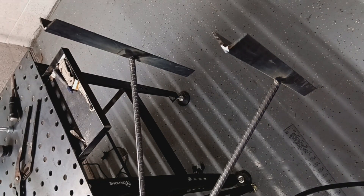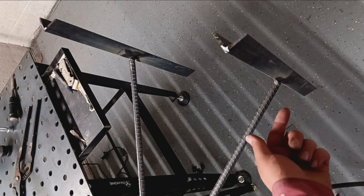There we go — I have both feet welded on. It was kind of a pain. Basically what I ended up doing was centering them with the table and then leaning the stand against the table while I tacked them, and then after they had been tacked I was able to run a full bead around the rebar on both sides filling in that gap.